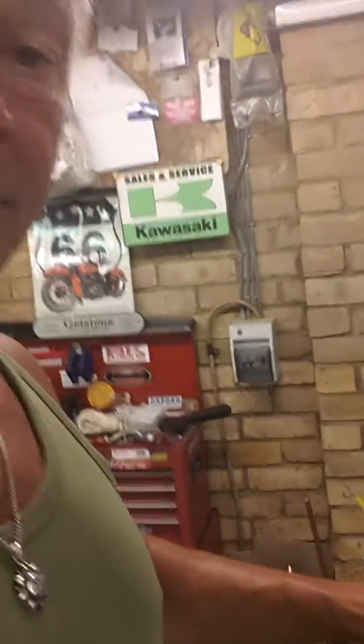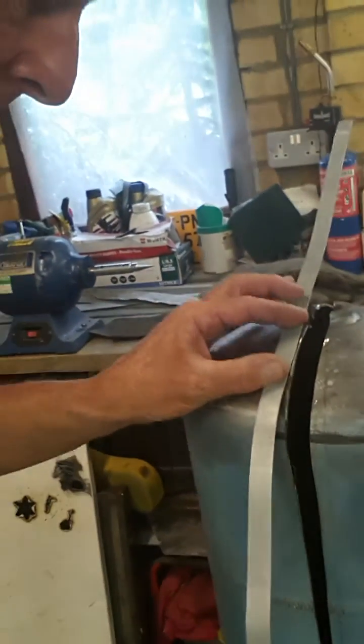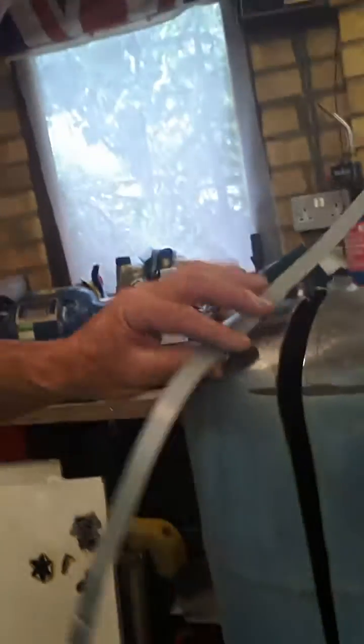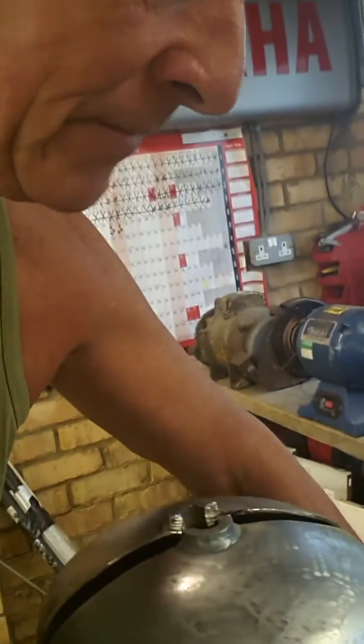Right, first procedure is that after you've got rid of the gas and taken your plug out, I've marked mine out just roughly, but you've got to cut this thing in half, because obviously it's a round bottle, so you need to elongate it to make it look like the camper van. What I found the best way of doing this is a really flexible strip of metal like that, really thin. The reason for that is because obviously this has got a curved top. So you can put your metal on there and bend it round to the shape of the bottle, and then you can scribe your line down, and that way you get a nice, fairly even cut all the way down. Okay, tip number 2 that was.